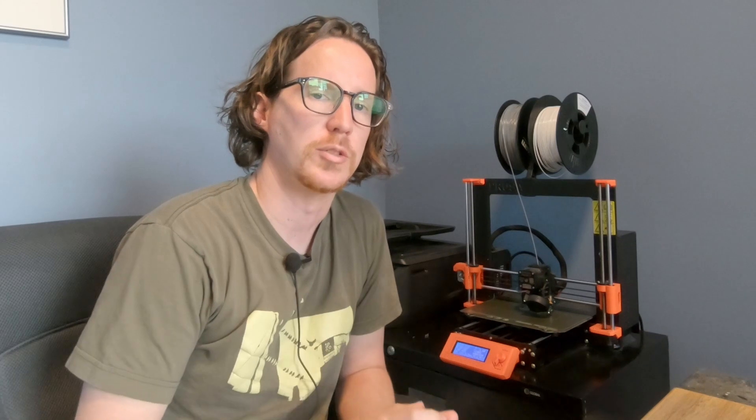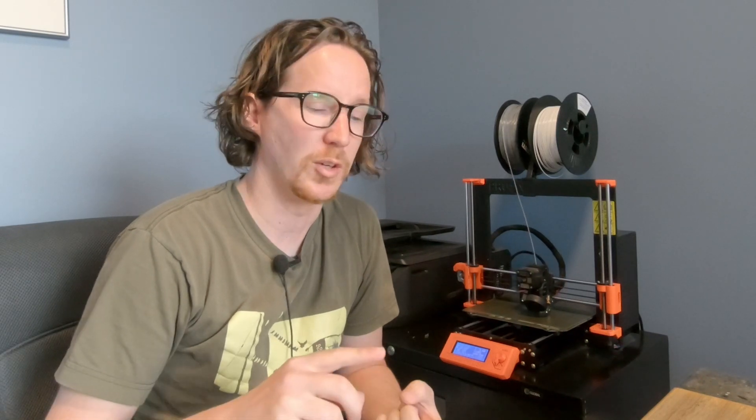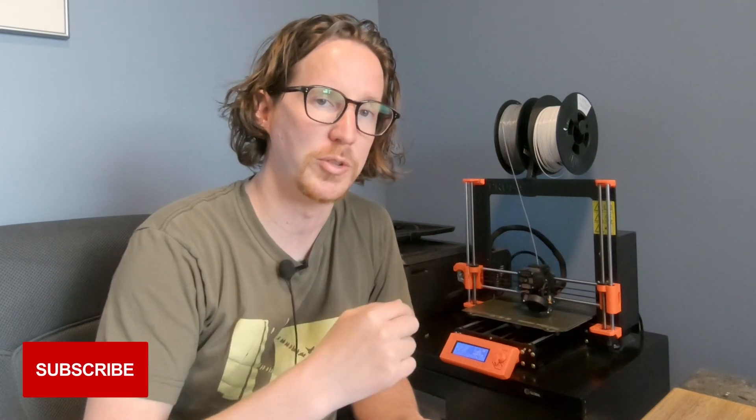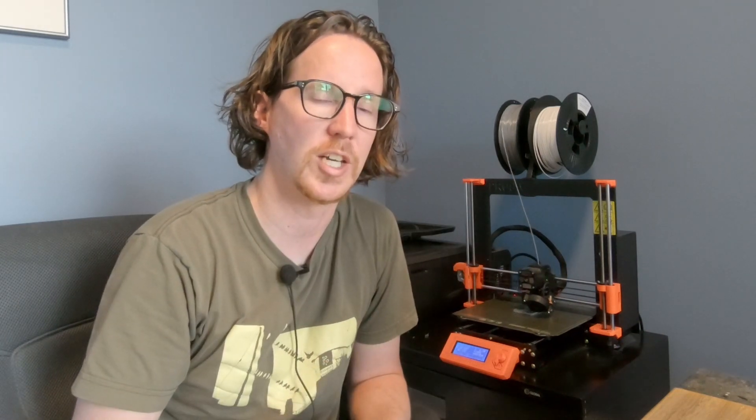Welcome back to another episode of Research Design Build. In today's episode I want to go back to 3D printing and talk about trying to resume failed prints. Your print might have failed for a number of reasons: if you have an older 3D printer it could be a power outage, or you could have accidentally cancelled your print — either when you pause it or it jams and rather than going to resume you hit cancel print on the Prusa. You could also have the extruder not grabbing the filament strongly enough, so it continues printing but no filament is actually coming out. In this video I'm going to show you how you can hopefully save your prints.